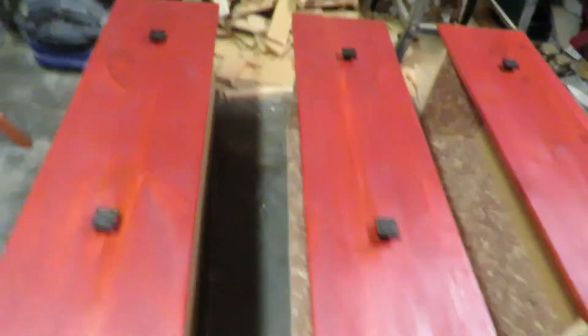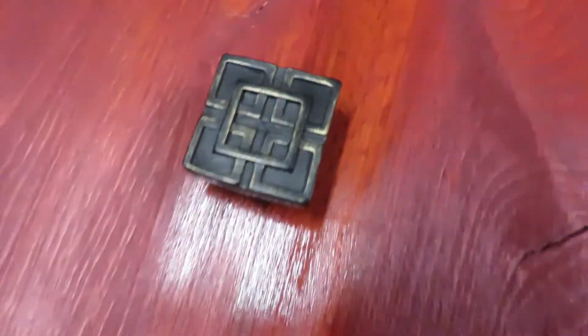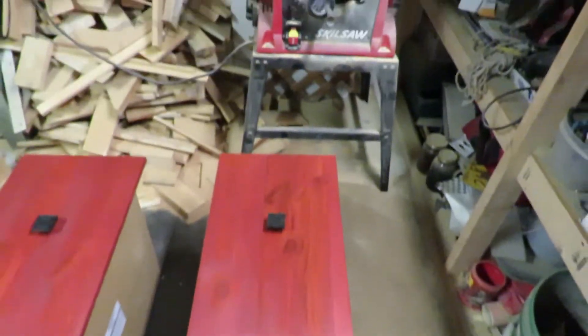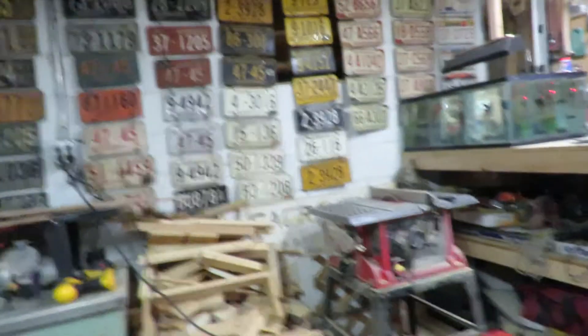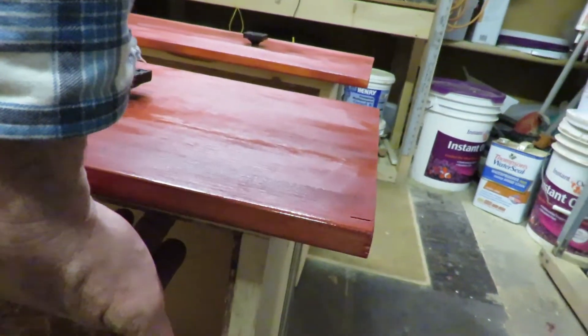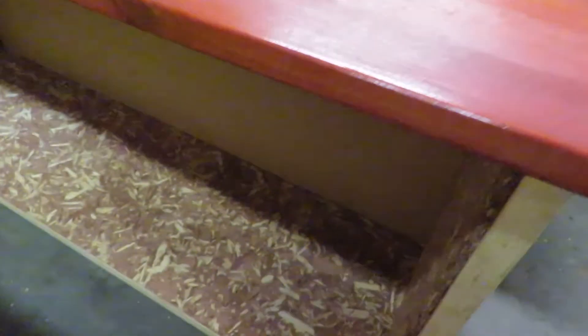Here are the drawers — I only have one coat of clear coat on those so far. They are stained, and she helped me do that. She picked out the drawer pulls and I think they look really nice. I did not router the top or the drawers because she didn't want that — she wanted a more contemporary look rather than a classic look, and those square corners are something she really liked. I made the drawers out of one-by-twelves, basically just building a box on four sides, with the same sheet material on the bottom, then screwing the face board on from the back side.